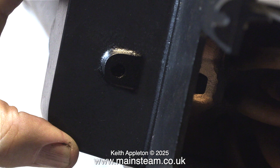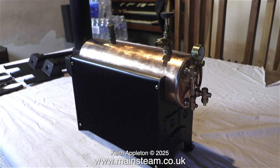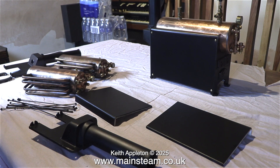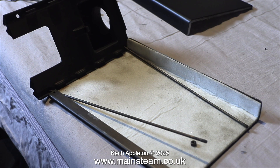I have to do this with both of the 501 boilers as well. Back to the 504 boiler — it's now sat on the table in a homogenous state, which means it's completely assembled. The construction of the 500 and 501 boilers is very different to a 504; in some ways it's a little bit more difficult to put together. The main difference is the absence of slot-headed screw heads on each corner of each side panel — instead, the 500 and 501 series use threaded rods like this.